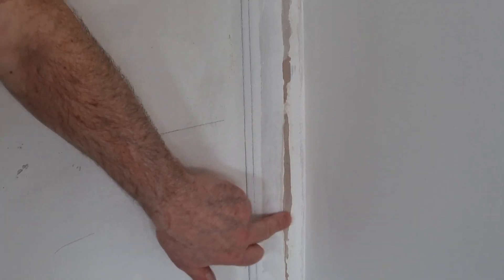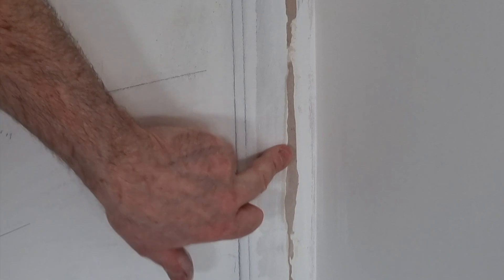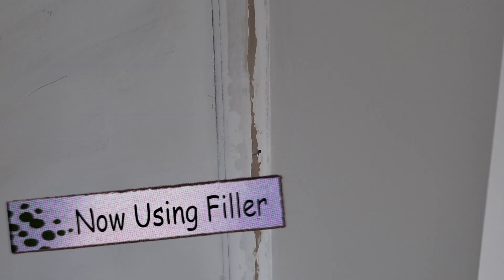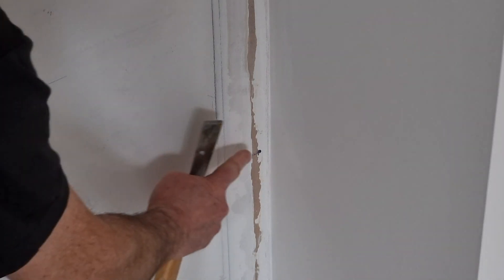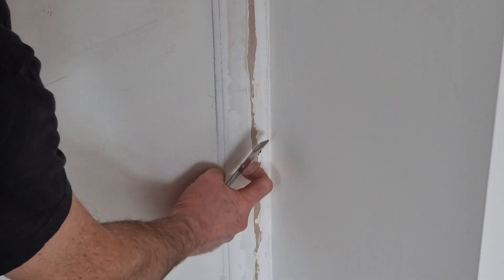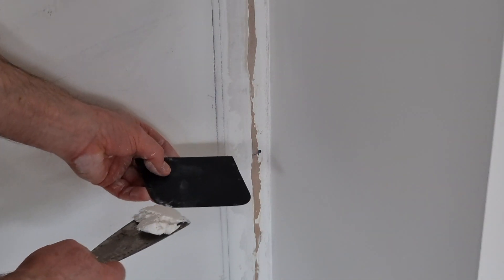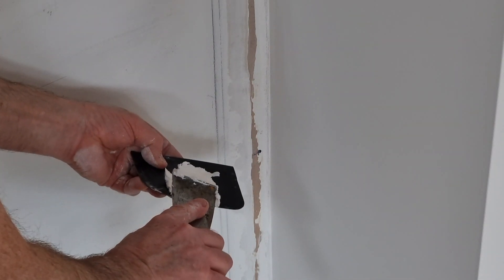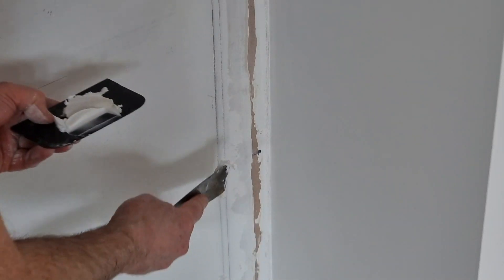And that's nice and smooth — ish. Obviously if I work a bit harder, but you get the drift of what I'm doing. Down here we'll try the other method. So this time all you want to be doing is filling the whole gap. There's your ridge and now you want to be filling that. Get yourself some filler, put your paste on, and all we're going to do is just fill that gap.